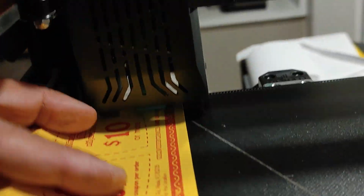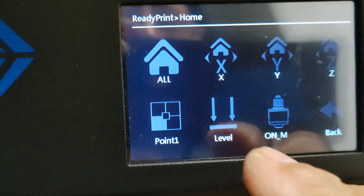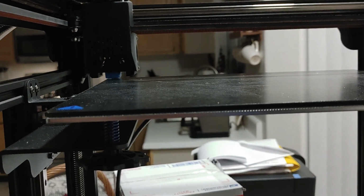So that should be fine right there. So if we insert a piece of paper there, actually I'm going twice as thick as this piece of paper here, just to give me a little more height there, so it doesn't scratch the table. So that's fine right there. So it's a little bit snug. So if we go to 0.1, this machine should go to 0.1.